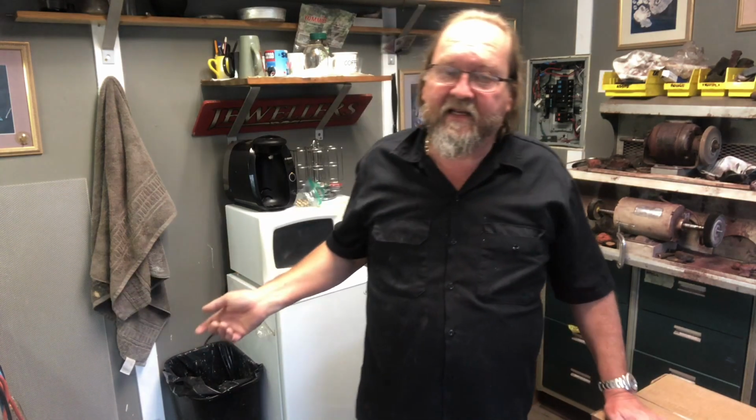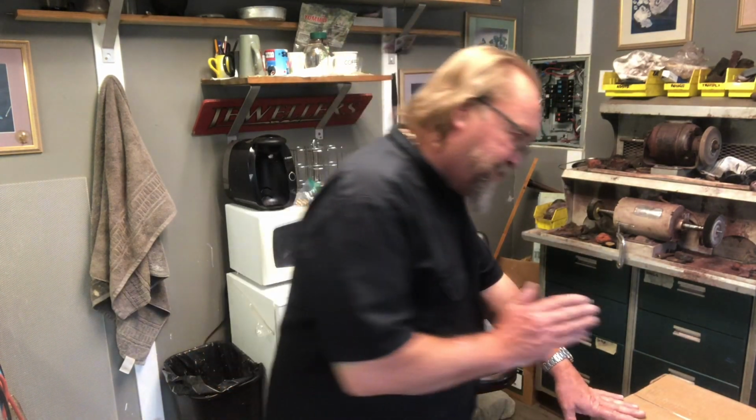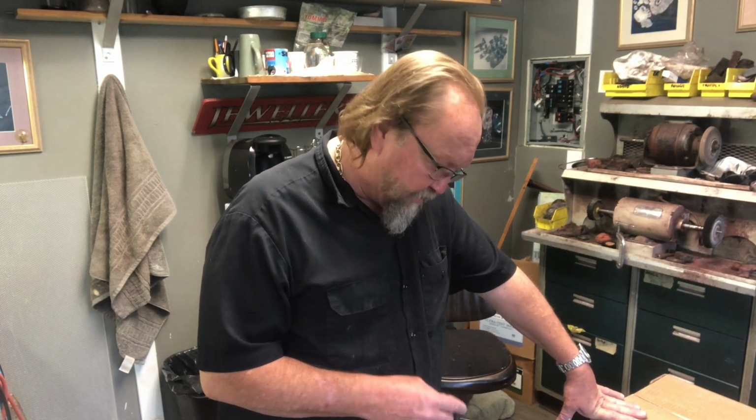I showed you mixing the investment, and sorry to everybody that I didn't use a scale. I just don't anymore, and I showed you the reason why. I've been doing it for 40 years. I can see what I want, and I know my product. I know what this can do, and I buy the same product. If you find something that works for you, stick with it. Ransom and Randolph makes a great product, and I just use UltraVest Max for everything.